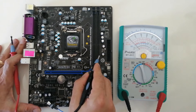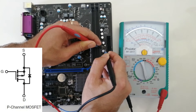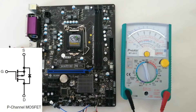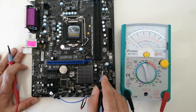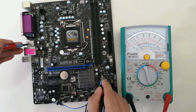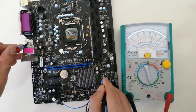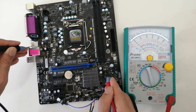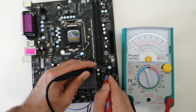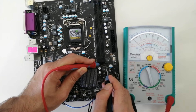Here I have a MOSFET which connects and disconnects plus 5VSB controlled by IO — it is a P-channel MOSFET. High ohm appears on one way and low ohm on drain to source — this MOSFET is OK. For the 1.05V PCH PWM, I perform ohm check on the drain of the low MOSFET or on the choke to GND: 7 to 8 ohm appears on one way, and 3 ohm on the other — this is normal. The high MOSFET is an N-channel MOSFET; high ohm appears on one way and low ohm on source to drain — ohm is normal. No short circuit found so far.